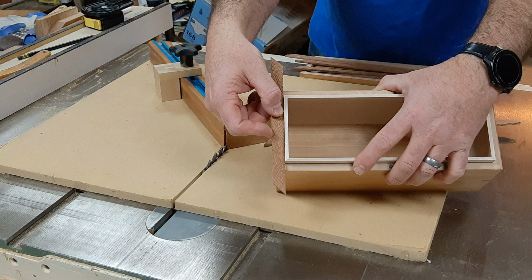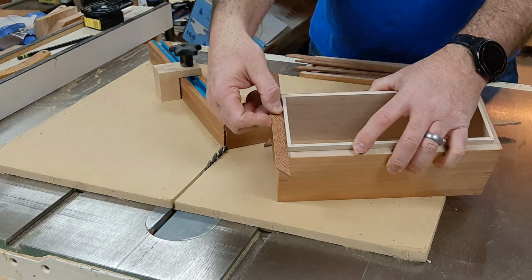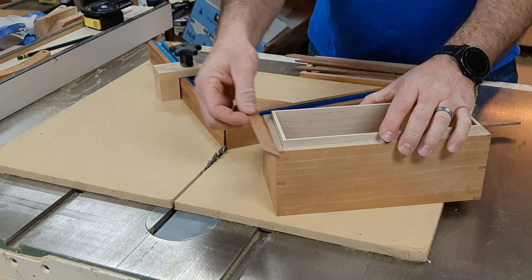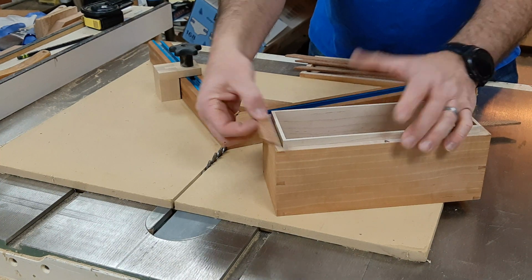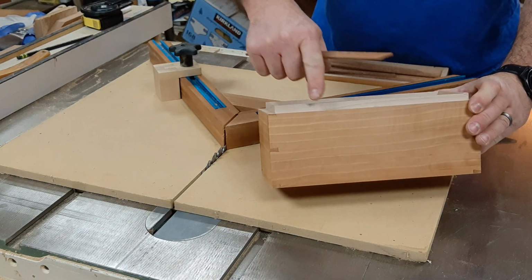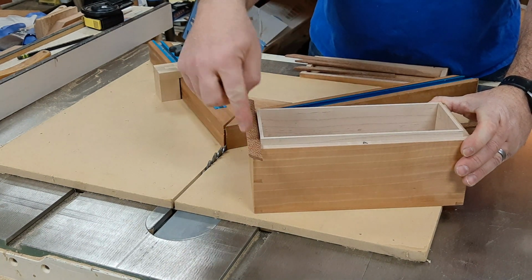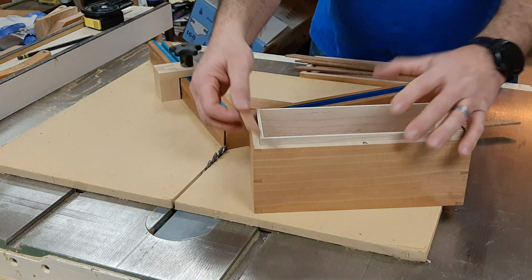And there's just the tiniest little gap on the inside from where this liner is. And I'm talking about tiny, just a little sliver, and that way I'm not going to rest this inside edge up against this liner. I'm going to butt this up against the piece, and if there's any irregularity on the edge of this piece, this will cover it up, and I'll glue all the way down to the bottom of this just to make sure it's nice and secure.